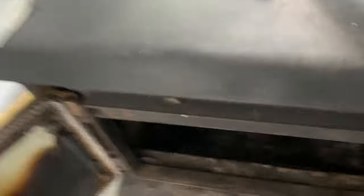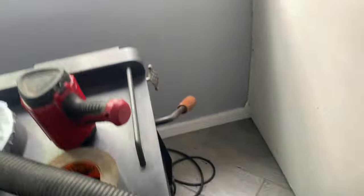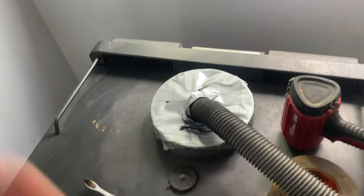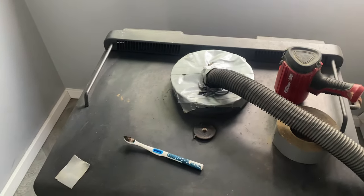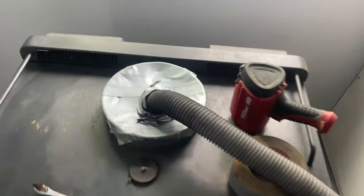I'm going to go through a test that not a lot of people might know about. Instead of using compressed air, which might be too abrasive for the ceramic combustor, we're going to use a vacuum. I've taped off the stove hole, the door is shut, and the flue is shut as well, so air will pass strictly through the combustor and pull everything through that's stuck. Let's fire that up — and immediately you can see it pull down the tape.